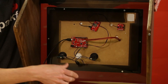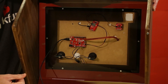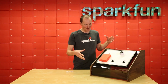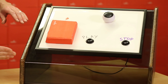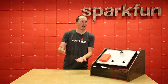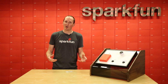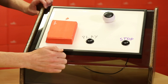This also has an extra button hole from a previous project — I just repurposed this whole faceplate. When I was walking around with this, everybody asked if I bent that plexiglass, because the enclosure looks pretty cool. I actually built this about three years ago for an audio demo booth. To bend the acrylic, there's a heating element strip — you lay the acrylic on top and it heats up. You want to bend it before you hear crackling or bubbling, because that means you've gone too far. Once it gets a little goopy you can bend your angles, and when it hardens it has a really nice finish.